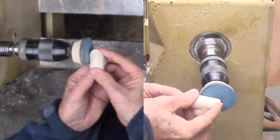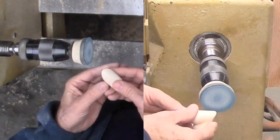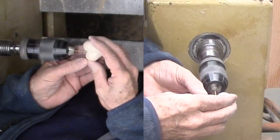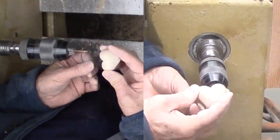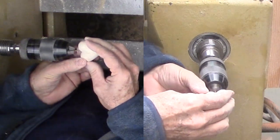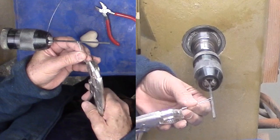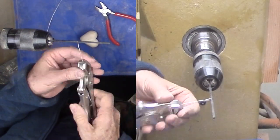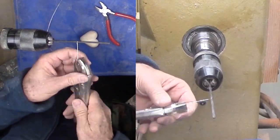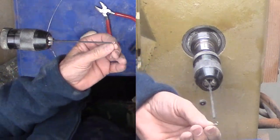Sanding now is with a sanding pad. I need to sand the joint and round over the bottom of the heart. Rather than using a drill press where I'd ram a bit into the heart somehow held on a table, I mounted a bit to the lathe and I'm pressing the heart to the bit by hand to drill the hole. This works for small diameter drills. For a hanger, I have a short length of silver-plated wire. I have a small diameter punch mounted to the lathe — I'm wrapping the wire around the punch and grabbing the ends with clamping pliers. After winding the wire to a tight wrap, I can cut it to length. Later, I'll glue it into the heart with CA glue.